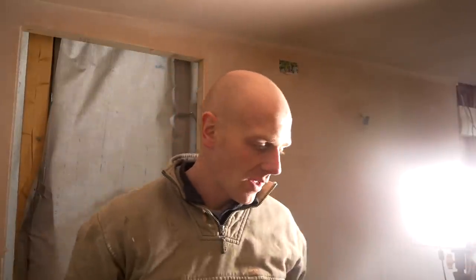The nice thing about plastering is if you get the timings right, you can have a cup of tea in between coats. Not too much plaster on me yet. So I've had a good clean out ready for the second coat — I need to make sure that's kind of touch dry. With the first coat, you don't want to be too precious about it as long as it's flat and it's on. I've done two walls and the ceiling, the walls being quite minor ones that are going to be hidden anyway.